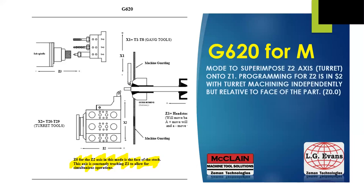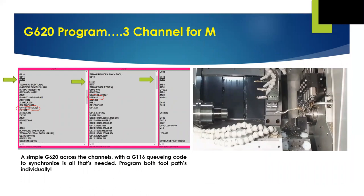Our next G600 code is the G620 for the M-platform. This code superimposes the turret Z (Z2) onto the part Z or Z1 axis. Unlike the G610, the turret now moves independently of the Z1 axis but always relative to it. This way we can combine a gang tool and a turret tool to work on the part together. One strong example is to bring a drill in on center to drill the face while the gang turns the OD, saving us the time of one entire operation. Also as shown in our layout drawing, the sub is still busy working on the back side. What do we do when we're faced with a large diameter bar with more than one roughing pass to get down to a particular diameter?